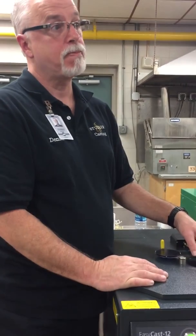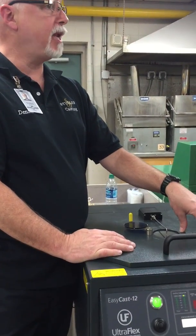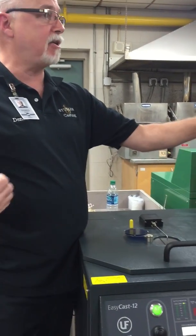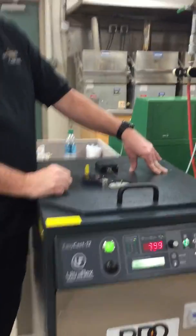So you don't do a vacuum on? If I was doing platinum, I would. Only platinum? Platinum or pure palladium, 950 palladium, I'd pull a vacuum. I'd take all the air out of there, and then I'd backfill it with some protective gas. But any white gold, yellow gold, silver, you just wouldn't worry about that. No vacuum, just cover gas.